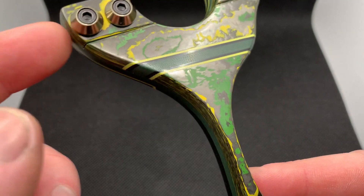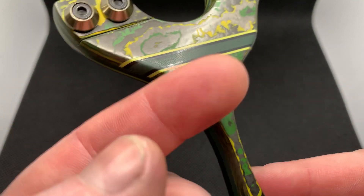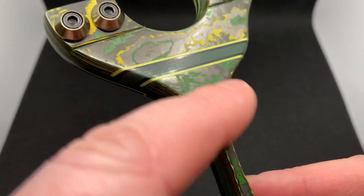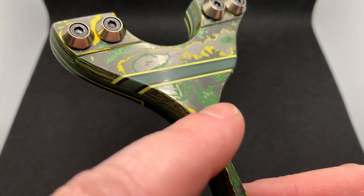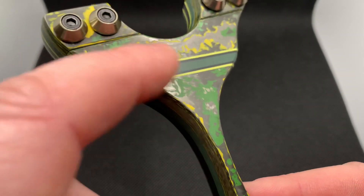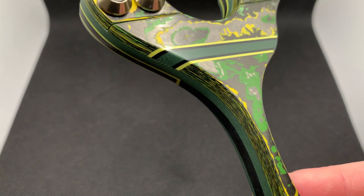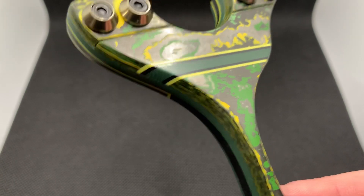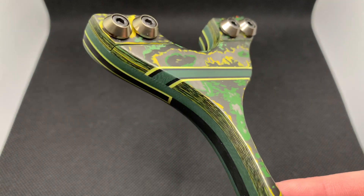Very cool carbon. I three-quartered the pins because this material can get a bit flaky — I know that through drilling the holes. You can push it out. I can get it off the clips no worries, but on this face I might have had to take a lot off to get rid of the flaking around the pins. So I went with three-quarter pins, and I think it looks better as well — it's not disturbing the pattern in any way.